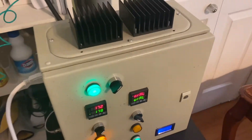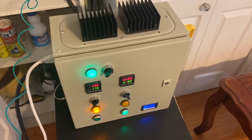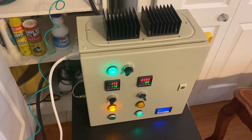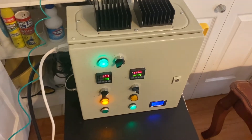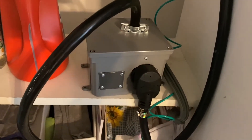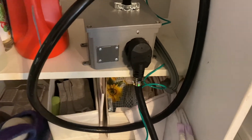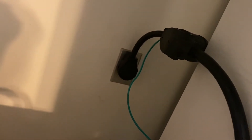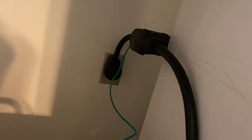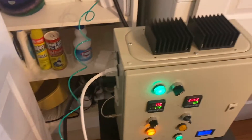When I moved into this house, the only 240-volt outlet I have is for the dryer and it's a 30-amp outlet, which since I'm only running one element is okay. But a 30-amp outlet is only three-pronged where a 50-amp outlet is four-pronged, so I couldn't physically plug it in. I built a little extension box — this end is a four-prong plug, and a small adapter converts from the three-prong wall outlet to a four-prong outlet. The adapter has a ground wire that plugs in, and that's how my brew box works.